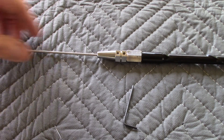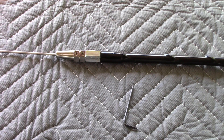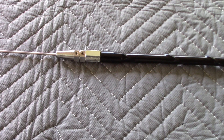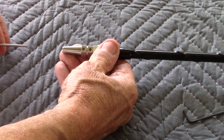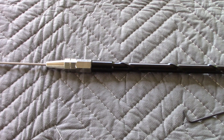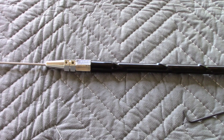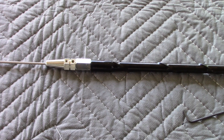This is where the tuning is on a ham stick. And when you buy them, you get an Allen wrench. But I've bought two of them and I can't even find the ones that came with mine. I had to break out the Allen wrenches out of the toolbox and find one to adjust these things. It's a very small Allen head, and your element will slide in and out. Nothing tricky about that — just straightforward, lock it down. And that's how you tune it. But out in the field, on top of the roof of a car or something, you're going to lose one of these. You drop it, it's gone forever. Another option is to find a metric screw the size of that, but I don't even like that.